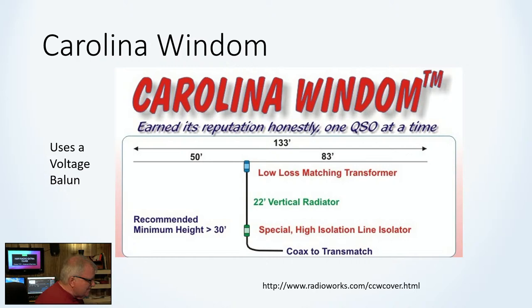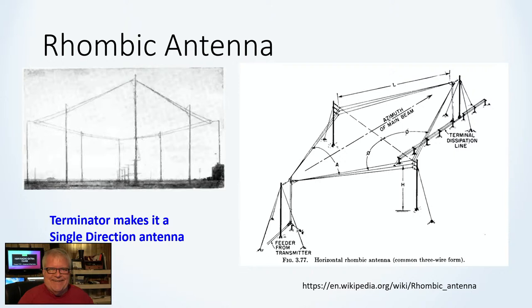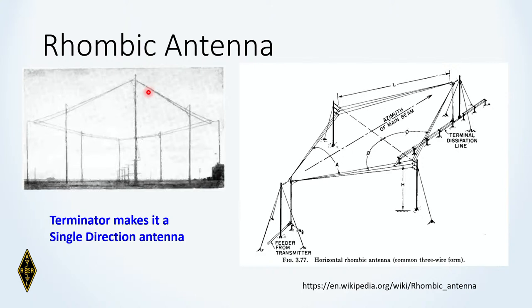This is what you want to have in your backyard. Your HOA won't like it, though. A rhombic antenna. We used to use these in Voice of America at receiver sites and at transmitter sites. These antennas have about a 15 dB forward gain. They're big antennas. They're, you know, full or multi-wavelength antennas up on large superstructures, poles, towers, what have you.